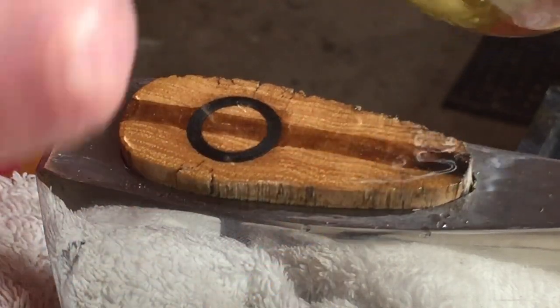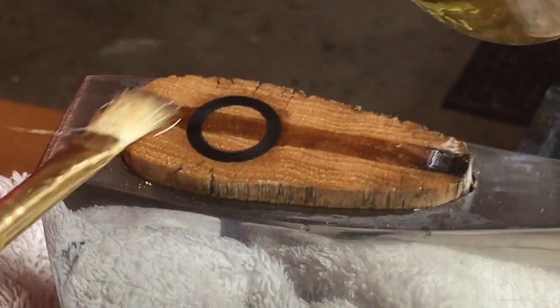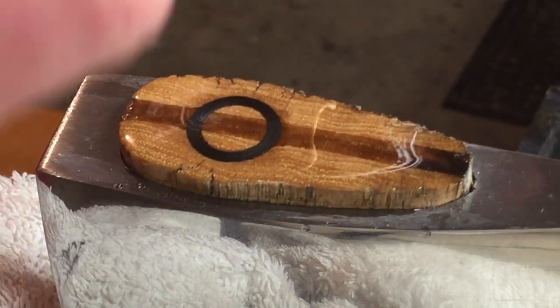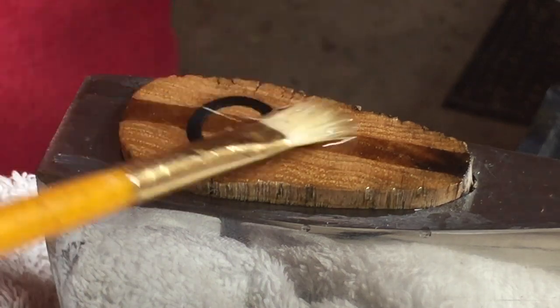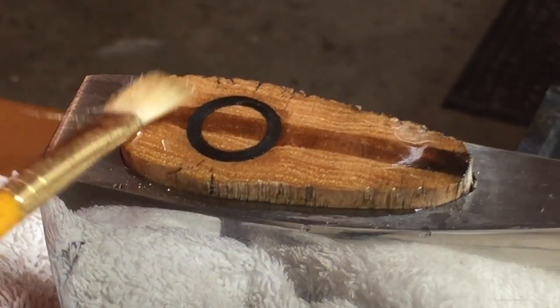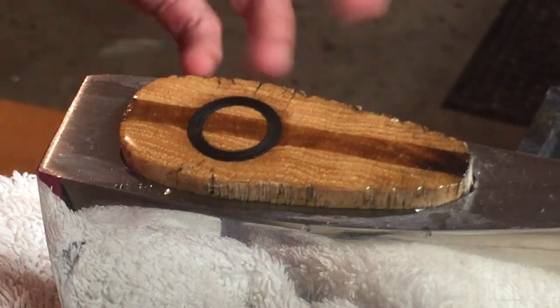as the way to oil the head. And I like to do it this way, so that the oil starts running down the grains, and if it needs the oil, man, it's amazing how much goes in, seriously. And you'll see it pop out down on the grain below. It's a pretty cool effect. You just got to keep doing this over and over and over, and it soaks in. It'll start slow, kind of saturate.